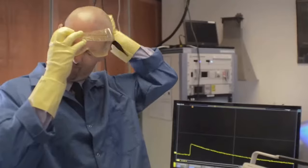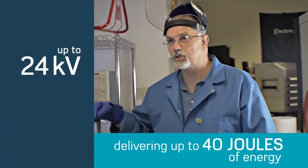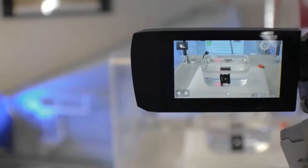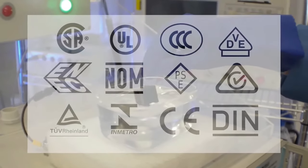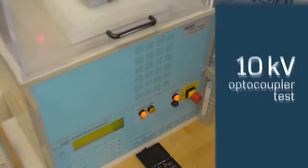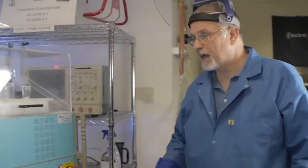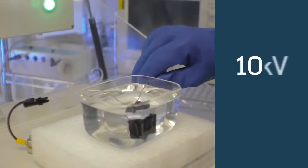What we have here is one of the most powerful surge testers on the market. It's up to 24 kV and will deliver up to 40 joules of power on every pulse — that's enough to ruin your whole day. We also have a high-speed camera to catch any failures. Is this the 1.2 by 50 microsecond pulse that the agencies use? It's exactly the same. VDE requires a 10 kV pulse as proof of reinforced insulation, so we're going to start with a 10 kV pulse. We all know the optocoupler is going to pass this test, but fair is fair and we need to test both of them.